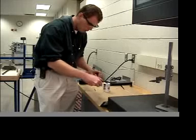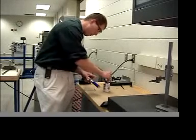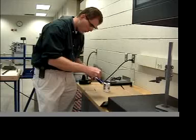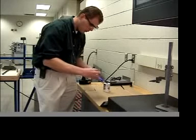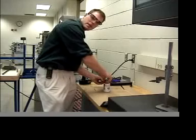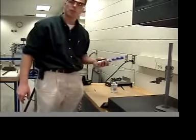Okay. If you have a lot of wax on your part, you should probably take the wax off before you do this. Maybe take some alcohol and a rag. Okay. Don't put it on too thick. It'll actually chip off if you put it on too thick. And don't leave this bottle open. It'll evaporate very quickly. Allow that to dry for maybe 30 seconds or so.